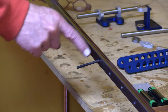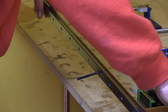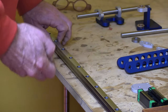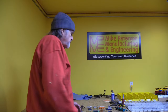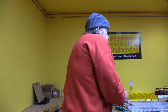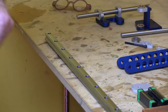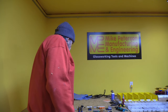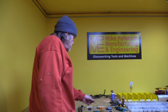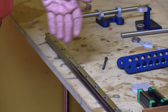I have a reasonably long 10-32 by two-and-a-half inch socket screw here. You could screw these in with a wood screw or a sheet metal screw, but they're a little bit weaker. A through hole with a 10-32 machine screw with a washer and a nut is going to be a much more secure mounting.